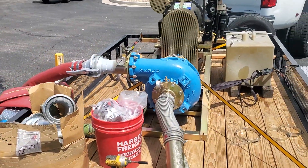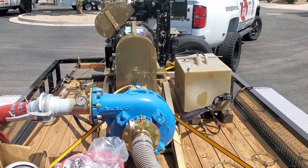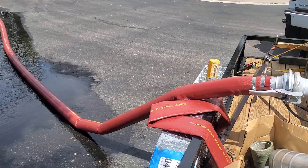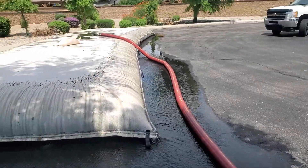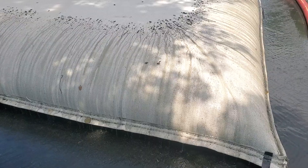It's going through our big diesel-driven centrifugal pump. That outputs out to this big mesh bag. You can see the dewatering process as it goes. The muck enters the bag, and then the water — it's a slurry as it goes into the bag — and then the water separates and filters out through the bag.